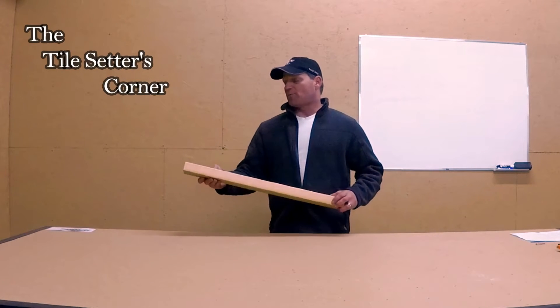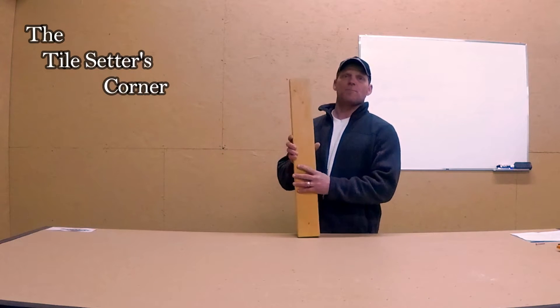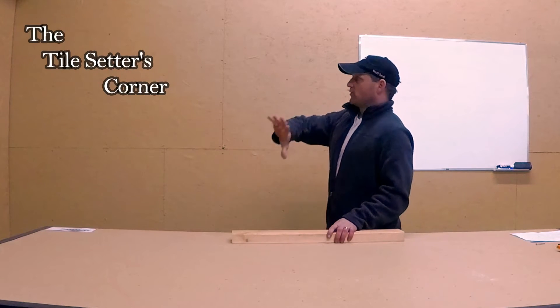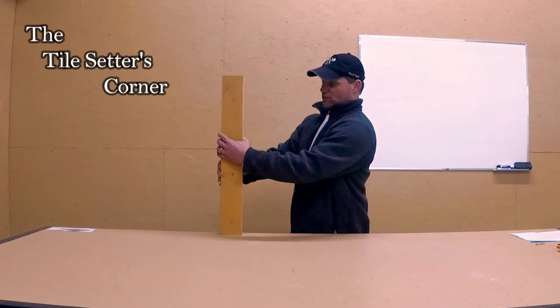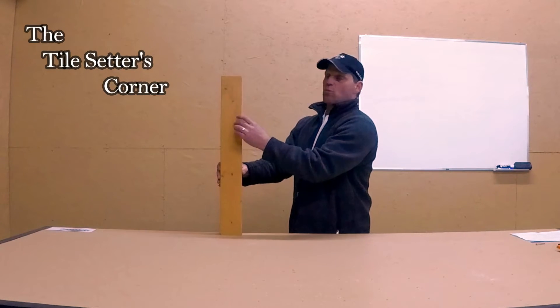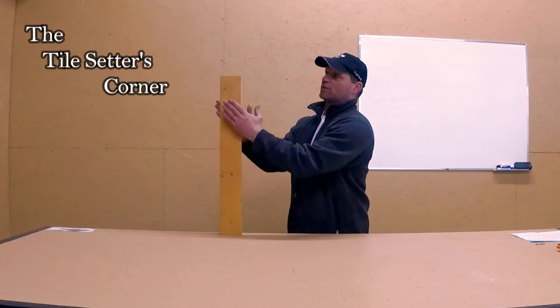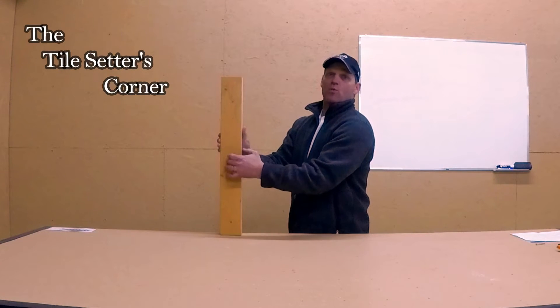There have been a lot of occasions where I've seen exposed lumber. Say if it was a shower and they put all their Dura Rock on the shower walls, but on the end wall it sits like this and they didn't cover it up. It has to be covered up as well because mortar will not stick to exposed lumber — it will end up falling off. It's something to do with the chemical that's in the lumber; it just doesn't allow the mortar to stick well.